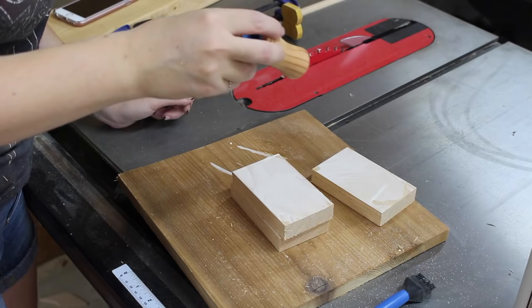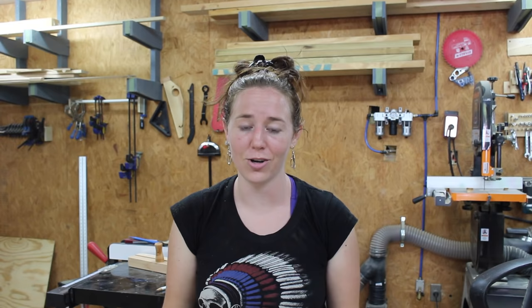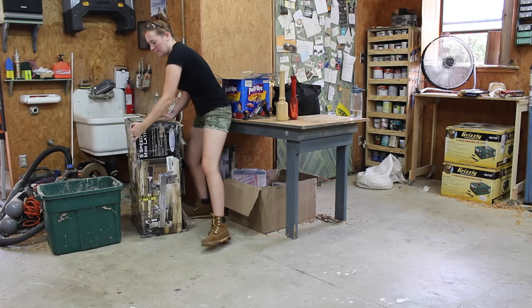In this video I'm going to be making a dedicated salt shaker for my wood shop. I don't know if you know the salt trick or not, but if you are doing a glue-up, you can sprinkle a little table salt on your boards and it creates a little traction so that the boards don't want to slip around on you so much whenever you're clamping them together. My problem is I always take the salt shaker out of my kitchen and forget to return it, so today I'm making a dedicated shaker to stay in my shop.